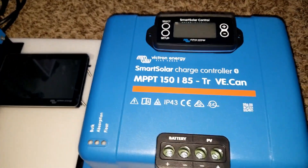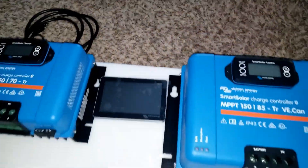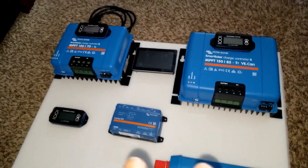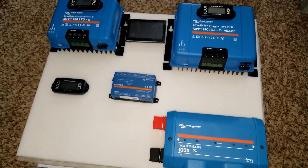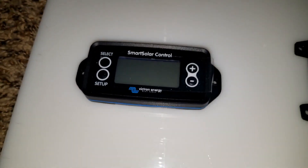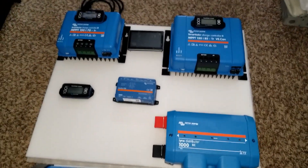I don't want it just embedded in the app. It's going to be like that, but it's also going to be up here on a big monitor — maybe a 50 or 55-inch television displaying everything via Victron online. And you'll be able to see everything. This is the next generation — which is going to be maybe a 250-volt, 100-amp charge controller incorporated here, or maybe I'll get the bigger one.